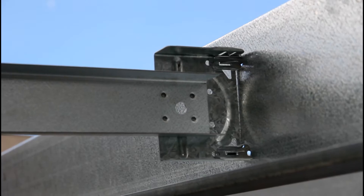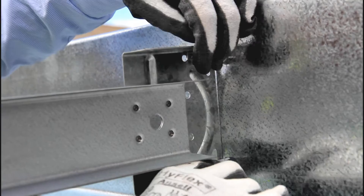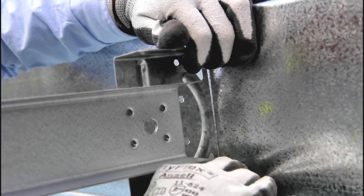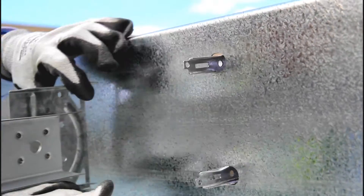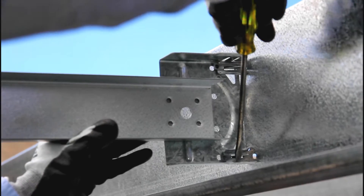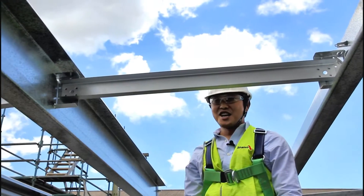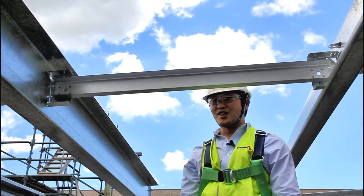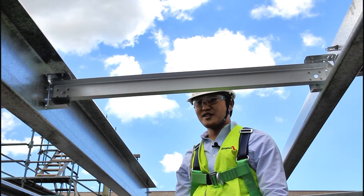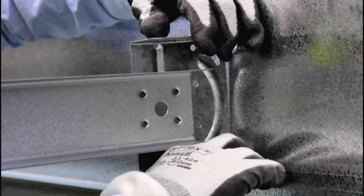I will start to unlock the end of the bridging I want to remove. The lock and locator components have spring tabs that interlock with each other. You can simply push these tabs apart and allow the lock and locator to move away from each other. If your fingers are not strong enough, then a small blade screwdriver will help. Next, go to the lock that is attached to the locator of the bridging you want to remove — it should be in the direction that the locators are pointing. Repeat the same procedure and release the lock.